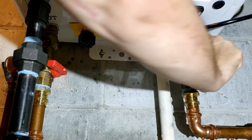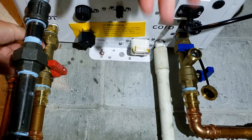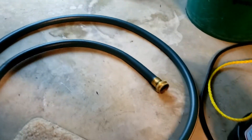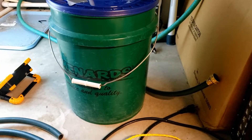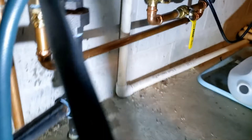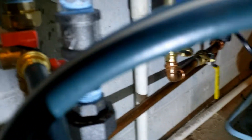I'll take these covers off. For materials I'm using a submersible pump, a small hose, and another half-inch hose going to the bucket with four gallons of white vinegar. The hose from the submersible pump is going over to the cold side inlet, and on the hot side I've got the other hose coming out. I have not opened these valves yet.